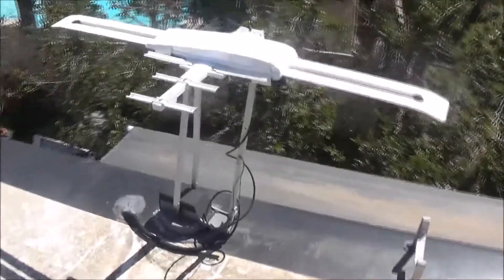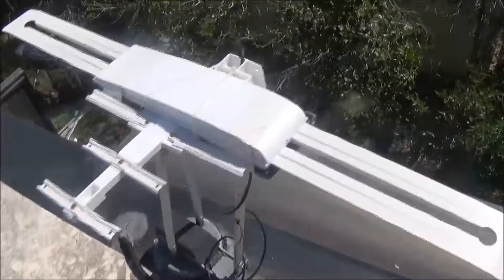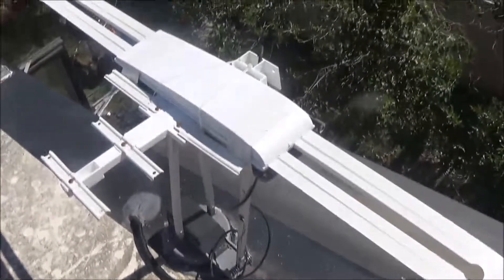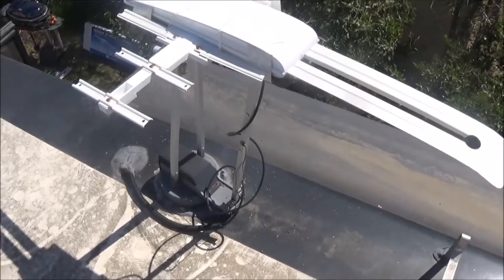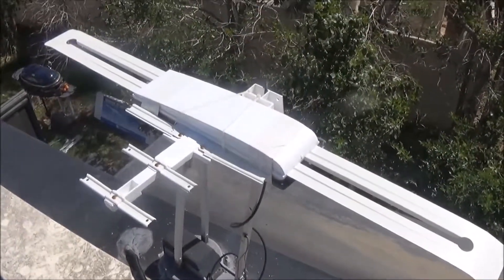So here we are up top. You can see there are the three legs, and this thing is sitting on top of the base of the Braun. This is that new Winegard Sensar 4 — it's supposed to be really, really good signal-wise. You can see it's nice and tight. The only wobble I'm getting is in the whole stand. I tightened down the zip ties real good — you can see I did them in a little bit of a diagonal — and it's holding great.